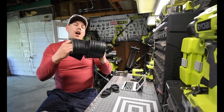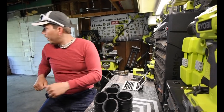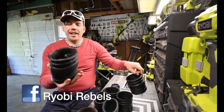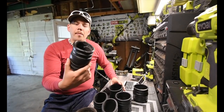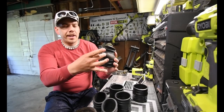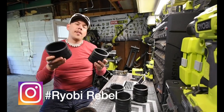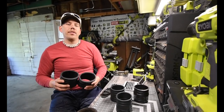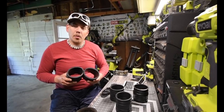And then these are the new hose connectors, which I think these are the hose bellows. These ones are the old ones. As you can see, the inside is not good compared to the new one. And these are melted and they're thin. So this one was ruptured in the middle right here, and I just cut the edges to get this one off. These are important to have because the water won't exit through the exhaust system and exit the boat. They'll spill into the bilge of the boat, and yeah, so your boat will sink.